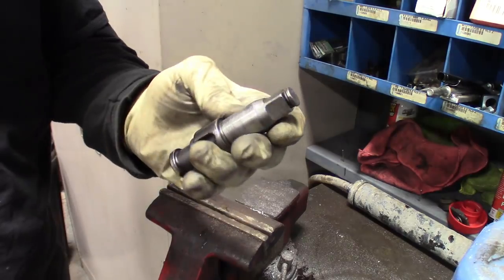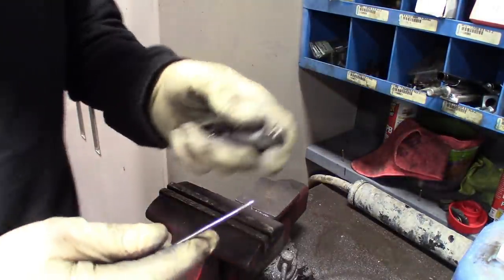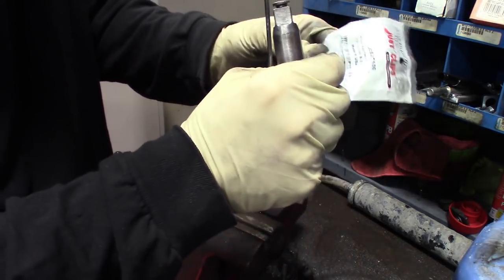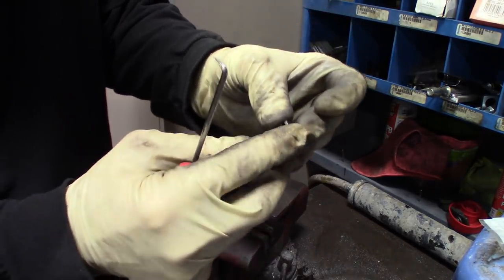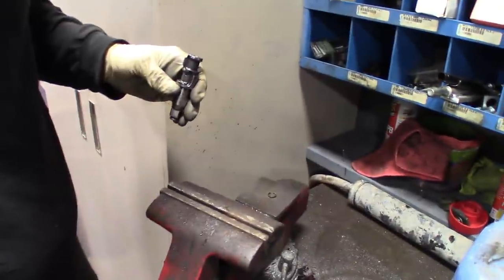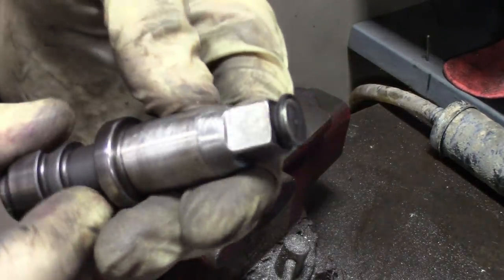I got the anvil here and I'm going to put in the retaining clip. These are the ones I use — they come with a new O-ring and then the metal clip. Pull the old O-ring out of here. If your retaining clips keep messing up or falling out, it's probably because the O-ring needs to be changed out, not just the clip. This comes with three rings and three clips. First put the ring on, then get the clip out. Basically just lay it on a flat surface and push down on it — it'll pop on. Then just push it on the rest of the way.